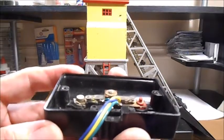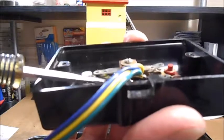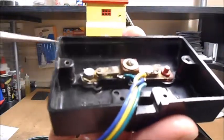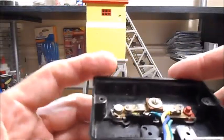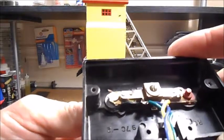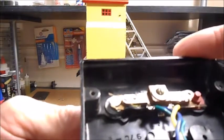This unit was missing an insulator. These things have to have an insulator between the bottom plate and the middle plate because of the way it's wired. When you turn this on — there it goes — it cycles on and off. Without the insulator, all three contacts were touching together.